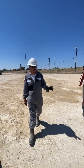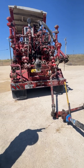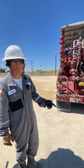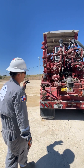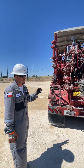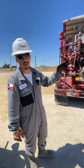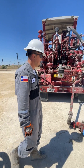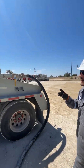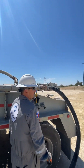So if temperatures were close to or below freezing when you rigged up on location, put your T-valve in line. In the instance that you were shut down for an extended period of time on a multi-stage job, you'd want to be able to clear your iron as well as fan your pumps without knocking anything loose. If you're shut down for a short period of time, shut your two inches, roll your centrifugal, roll your triplex pumps back through, and that would suffice. For an extended period of time, your supervisor's got the iron knocked loose from the cement head, secured in the mouse hole, and all rig hands are off the rig floor. We'll open up our one-inch valve — got no pressure on the pots, compressor is engaged, pots open, bleed-offs open. Go ahead and ease into it.